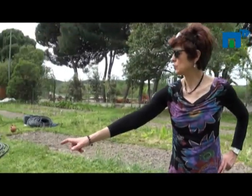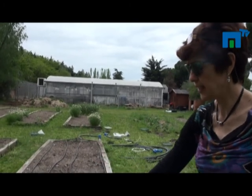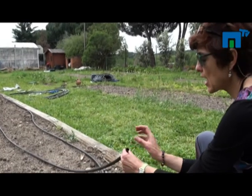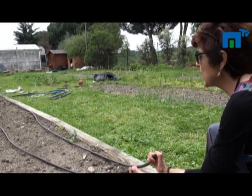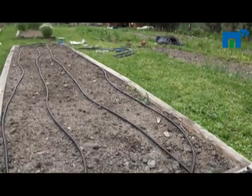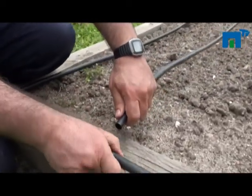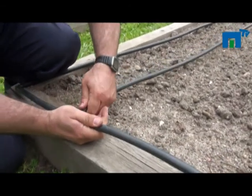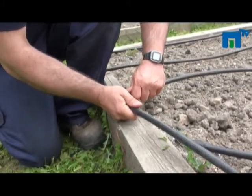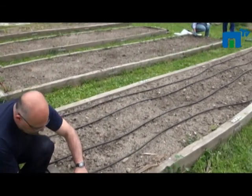The emitter spacing is chosen according to the crop's physiological requirements and planting spacing — in this case, 30 cm apart. For a typical drip irrigation unit, at the end of each lateral there is usually a plug to stop the water. But in this case we have a non-branched loop design, meaning the end of the lateral water is connected to another tertiary path, so water moving from upstream going downstream can also go in reverse. With this design, the pressure variability is not as high, meaning better water distribution uniformity and higher irrigation efficiency.